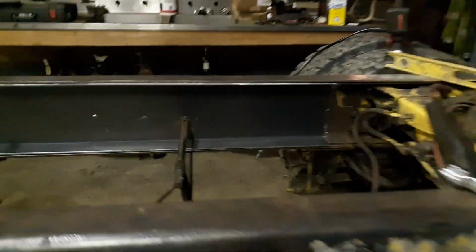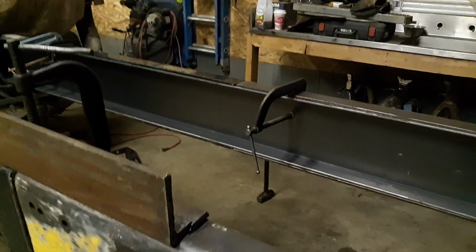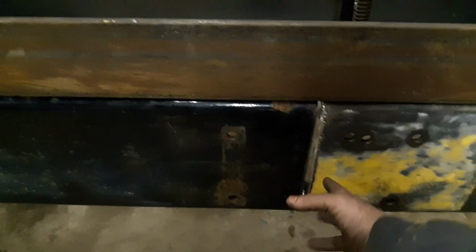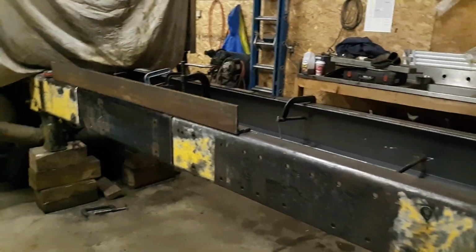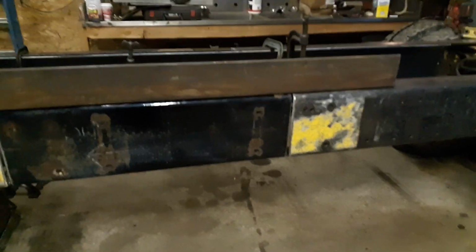So this is 1/4 inch steel insert, had them bent up at the local truck frame shop. This is used frame we found at the wrecking yard. We're gonna tighten this gap off a little bit, obviously. I'm just showing you an overall video of the first fit up, and then tomorrow when we get it welded and jigged in there, I'll make another video and show you all the progress. These are 9-foot 10-inch inserts. Ended up being the length on them, 9-foot 10-inch. Our piece that we're scabbing in is 3 feet long. So we got some major overlap and doubling up and spreading the joints out, and